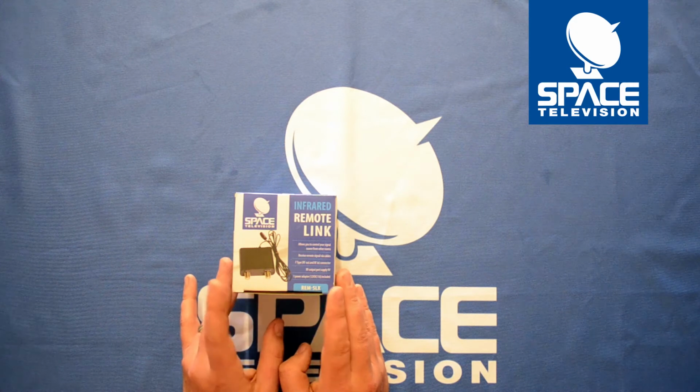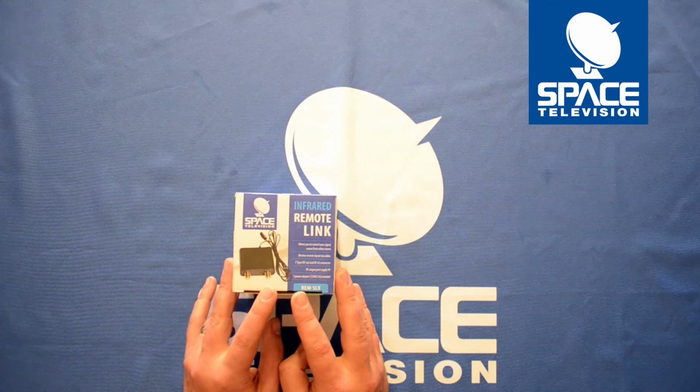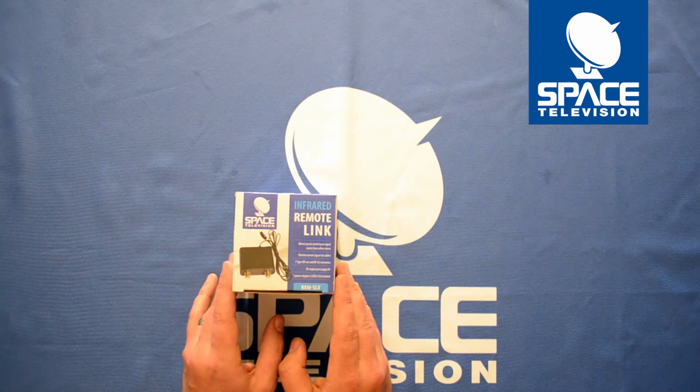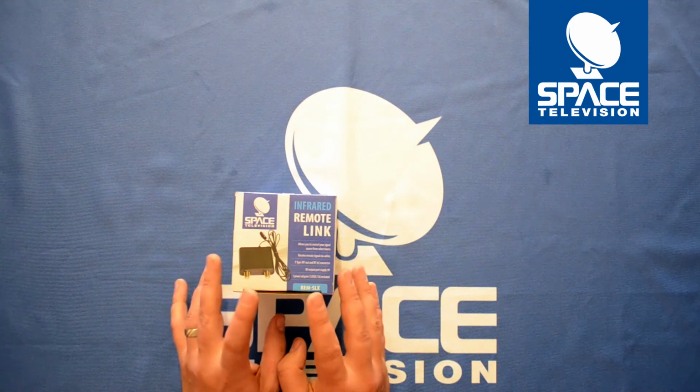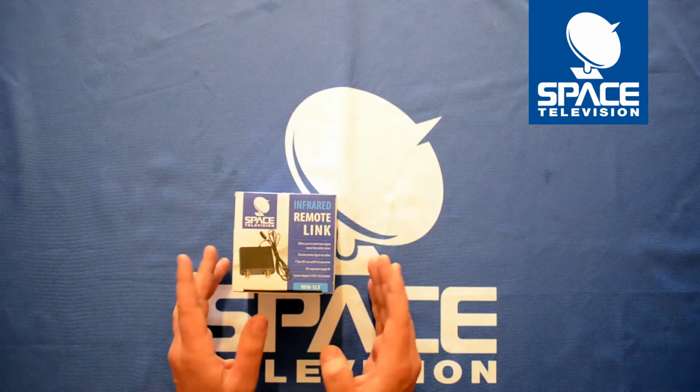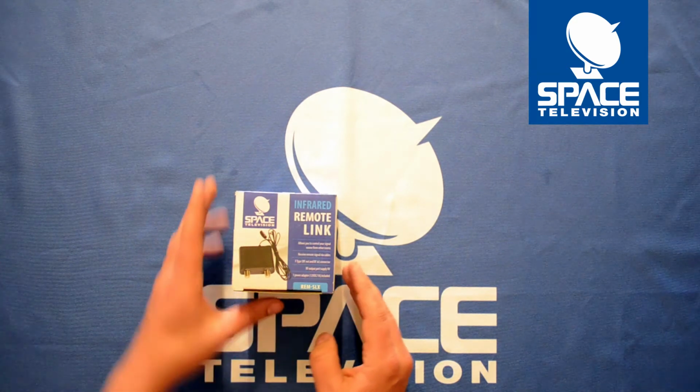Another application for this is if you're using a modulator such as the AVM01 or the MD410 that does not output DC along the trunk to power up a TV link, you would use this device here in order to send power down to switch on SLXs or TV links.